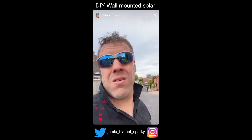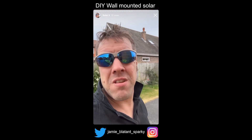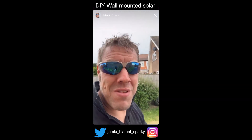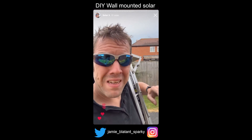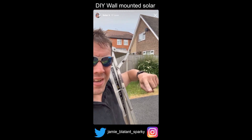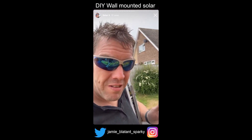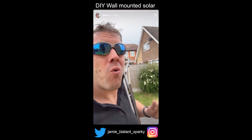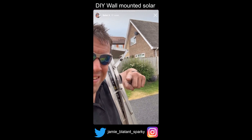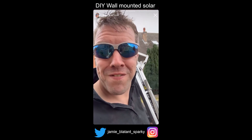It's raining now — overcast — not that I'm moaning because when it's sunny here the panels are in sun from half past seven to half past four and I'd be sweating my tits off getting sunburned. Hopefully I can get these banged up, it'll stop raining, and tomorrow when it's gleaming I'll get the free electricity. Why I'm careful and quite scared of DC: I understand it — I've done some 2,000-amp DC work. With AC, the sine wave goes through zero 50 times a second, so when you break an arc it'll dissipate. With DC it's either full whack or nothing — if you draw an arc you'll keep drawing it until you pull it far enough away, it burns out, or it kills you. With DC it'll keep you hanging on until you're crispy.